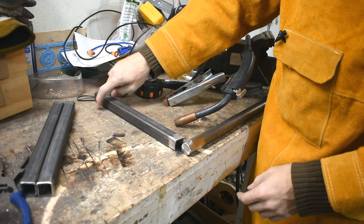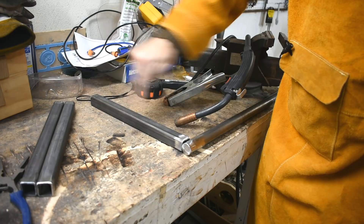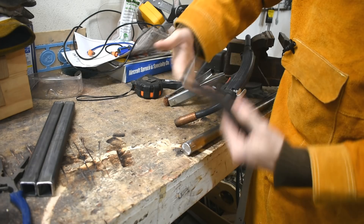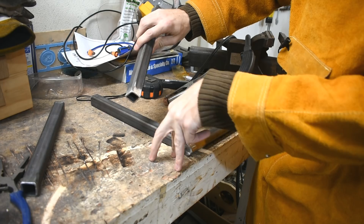I'm going to stick these on at kind of an angle — you might notice this is not 90 degrees. When I cut these with an angle grinder they're kind of not straight because I'm incompetent at cutting. But I'm going to own it and weld them on at a slight angle. So when I have three of them — three because a three leg stool doesn't rock but a four leg one does — the tips of the feet will touch the ground, not the middle.